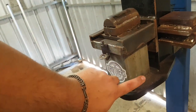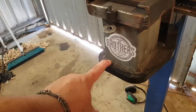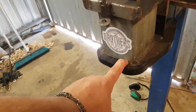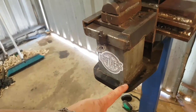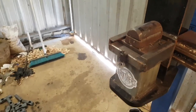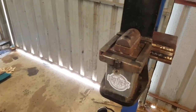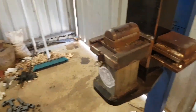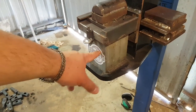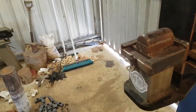The post is actually just RHS — rolled hollow section. You'll notice it's not welded at the front. The reason for that is because welds can create heat affected zones which crack quite easily, so we welded both sides but the front and back are not welded, meaning there's a more solid join there. All of the pressure is going vertical on this piece. It's only hollow, but you'd probably need 100 or 120 tons to start buckling this — it's got 4mm thick walls, so quite stout.